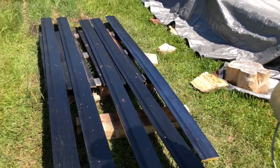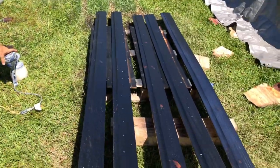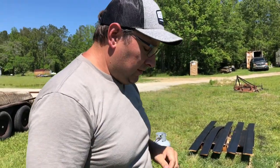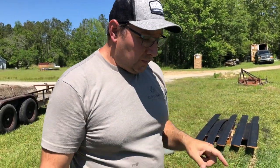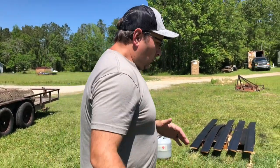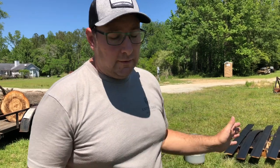That's how quick and easy this gun works. There are a few random drips which I'm going to wipe off with my finger — my bowl wasn't tight enough so there was a small gap leaking as I sprayed. One thing to mention: when spraying polycrylic, you definitely want to strain it first. I use a paint strainer or cheesecloth that you can pick up at any grocery store. We'll let that dry — it takes about 15 to 20 minutes before we can recoat — and we'll probably put three or four coats on.